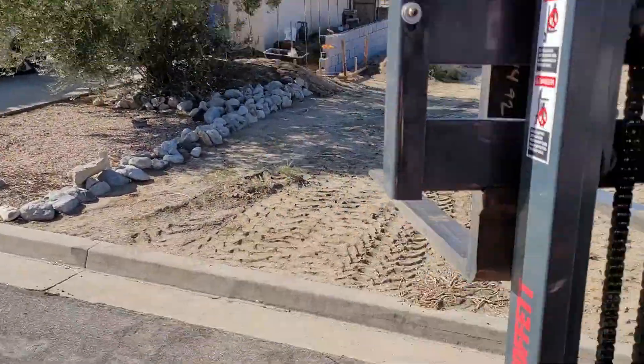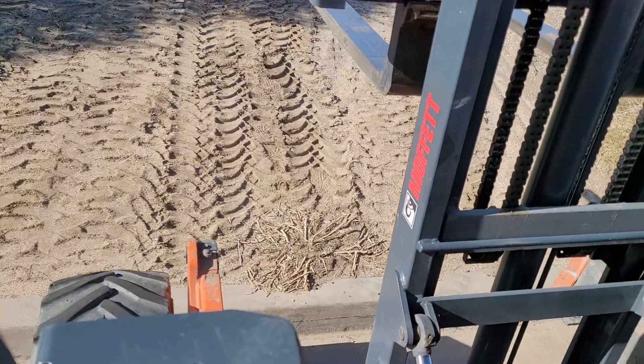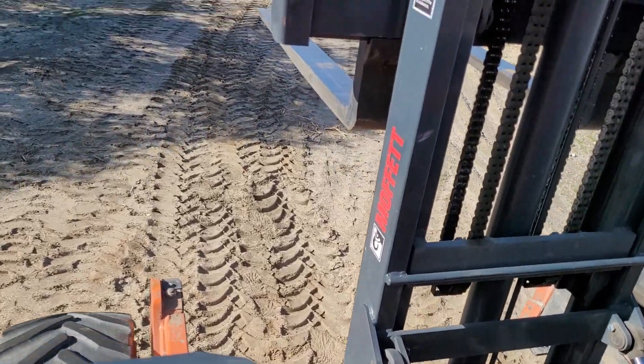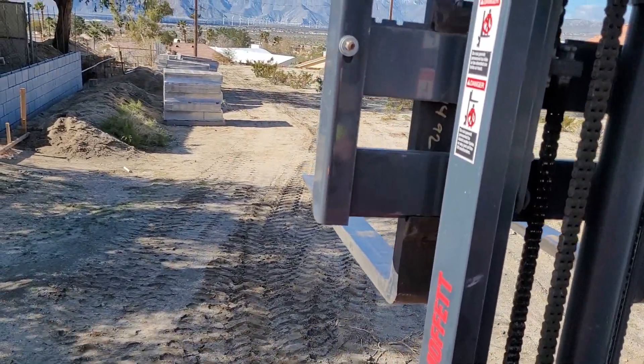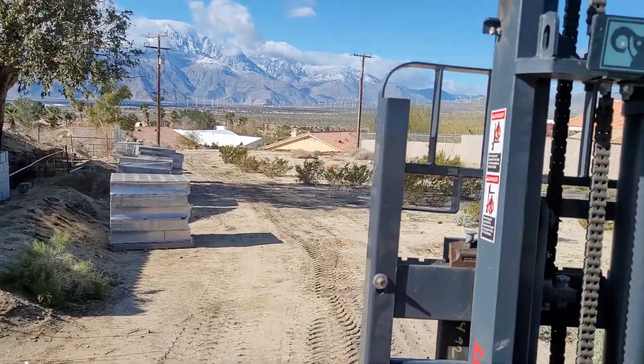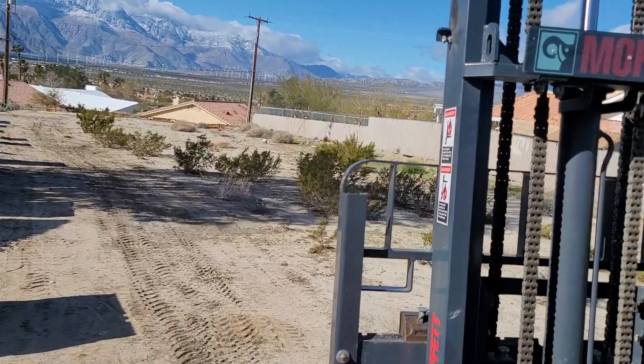In this case we're going empty up, so I'm still locking the differential. But that can be hard on the Moffett with the climb with a heavy load, so you can make yourself that step with some lumber — that's what I was trying to explain on the last delivery, if that wasn't cleared up.